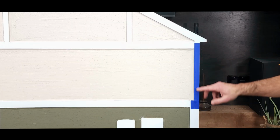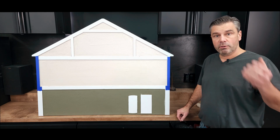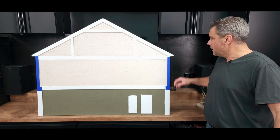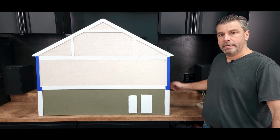When we're looking at the exterior walls, if you need to insulate the exterior walls here, you could use fiberglass if you have the drywall off, or possibly spray foam. If you have drywall on the inside, siding on the outside, it's really not that difficult.